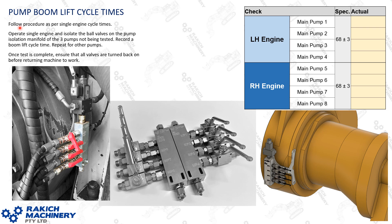One thing we very strongly encourage when troubleshooting hydraulic excavators of any model is single pump cycle times on a boom lift cycle. When your boom cylinders are fully extended, if you have the cylinder dimensions you have a known volume, and when you're sending flow from only one pump to those two cylinders you can time that, do a calculation, and get your flow rate in litres per minute. The expected cycle time for a single main pump on a 6090 is 68 seconds plus or minus. We have pump isolation valves that you can fit to your machine — complete kits with mounting brackets, hoses and fittings — and it's game-changing for quick troubleshooting in the field.